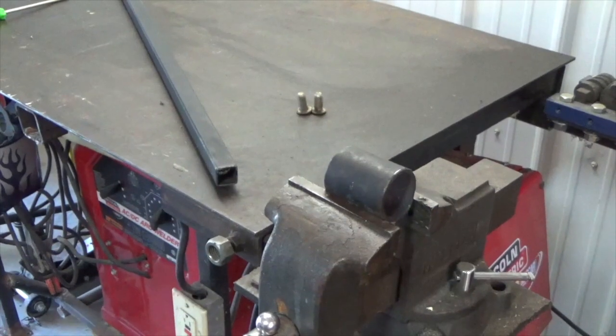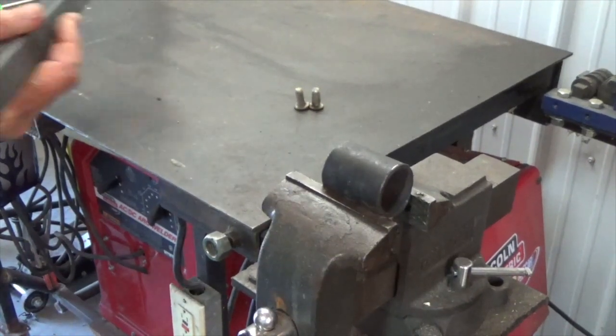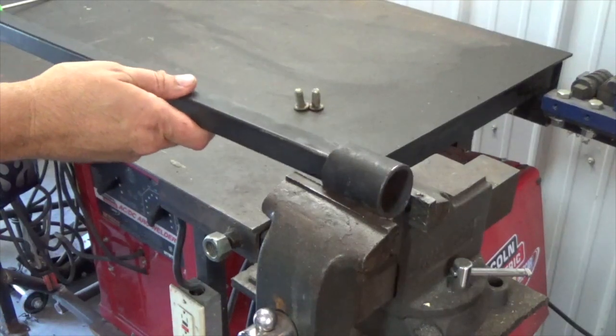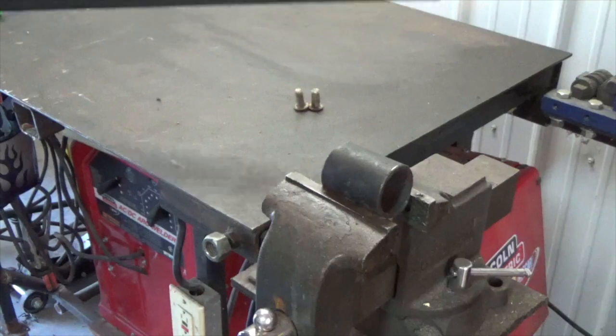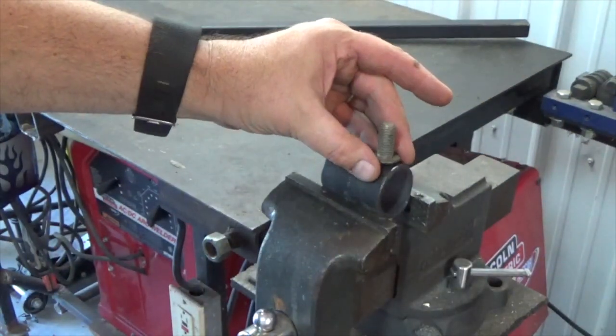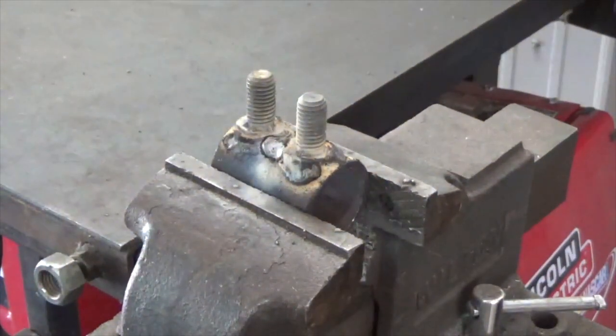The first thing I did was choose a 1 inch square tubing for my bar. I then cut a heavy gauge pipe, about 2 to 3 inches, that will receive perfectly the square tubing. The pipe will need two bolts welded in line on one side. It's a good idea to choose heavy duty, high quality steel bolts — this will ensure a strong weld.